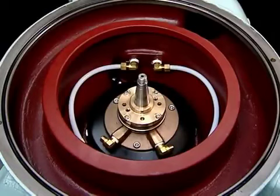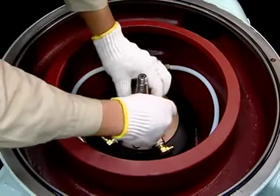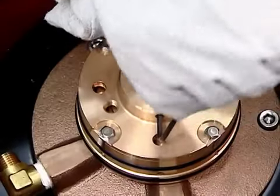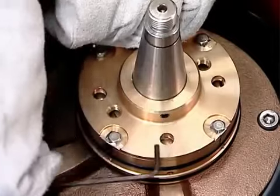If the slits become clogged because fur forms on the water supplying device, clean the operating water line with a straightener. If operating water is supplied to the tank, clean the tank as well. Tighten the socket set screw on the chamber cover and remove the three socket cap screws fastened to the operating water disc.